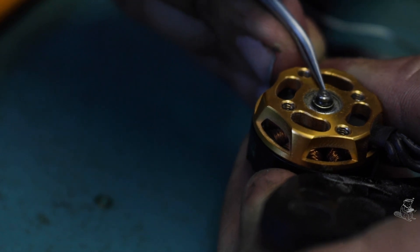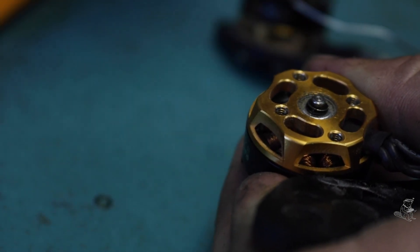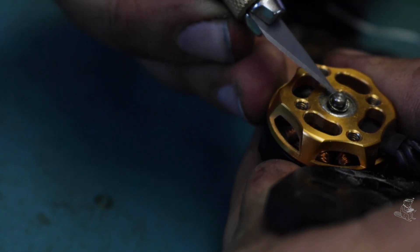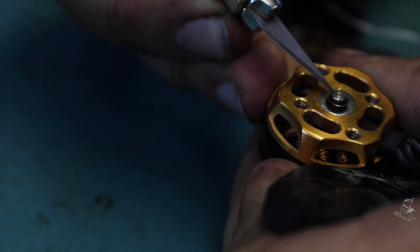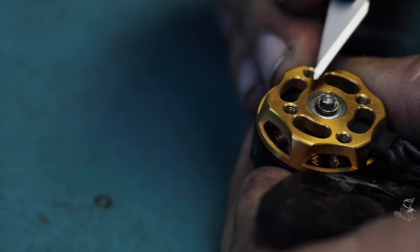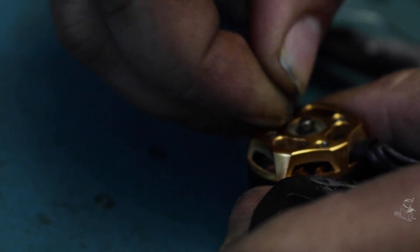I don't know that the order matters, it's just spacing that needs to be kept. These little things are really fiddly — they get hung up in the groove that the e-clip goes in, so you've got to wiggle them out, or sometimes you can just rip them off. Even if they get a little out of shape it doesn't really matter; you can press them back into shape and it's all good.